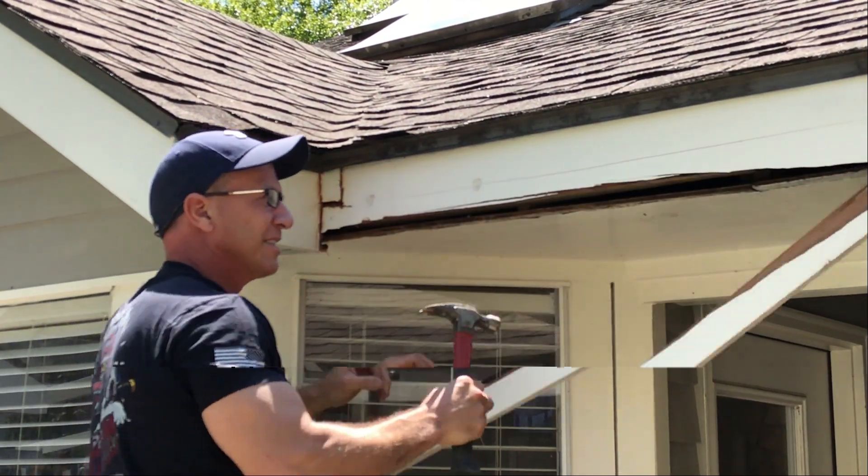You can't tell there, but when we go to put it in it should be just right. This is Titebond 3 — it's a little watery but it's an excellent exterior glue, so you might get a little drip; you're going to want to wipe it after with a wet rag. I'm going to put it in there — oh sweet. I'm going to bring this down a little bit right here. There you go — now it's even.